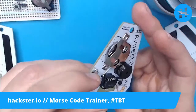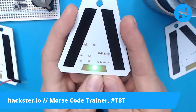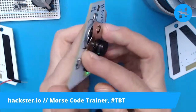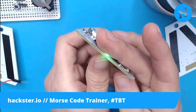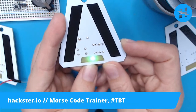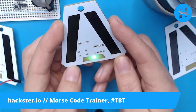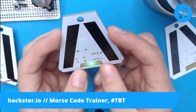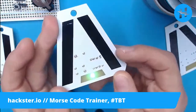I'm very excited to have a bunch of new ATtiny chips fresh from the factory that will all be the same - whatever that same is, they'll all work the same, hopefully. Here is our final version. I may do more versions of this. This is my first time using a shine-through LED, so it'd be nice to have more distribution across here - maybe two or three SMD LEDs instead of just one. That would require some reworking of the power situation. I could also play with the thickness of the PCB, which might affect the distribution of light as well. But I actually kind of like it like this - it's pretty bright already. If I made it thicker, it would be a lot heavier and less elegant, but it might diffuse the LED better. Maybe some smaller LEDs but better distributed. However, what you get with that is that it's harder to solder, and I like being able to do this stuff by hand. For me, 1206 is a really nice size for SMD components.